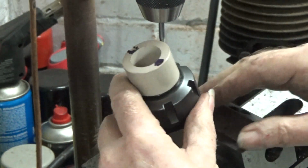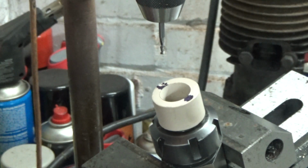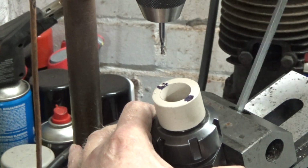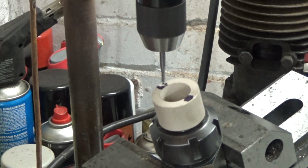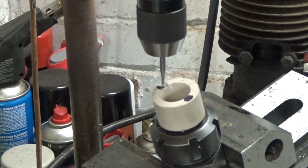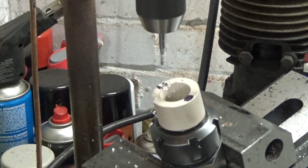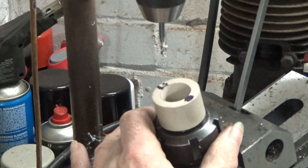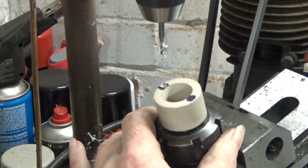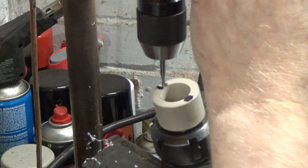Out of view at the bottom of the screen is an end stop of the vise. This is rather important as the collet block needs to be rotated exactly around its axis between settings. As I think I said earlier, the drill table should not move once the setup is in place. I had to pick up the hole again.